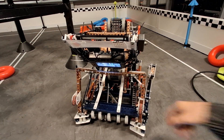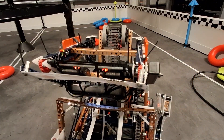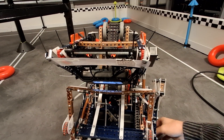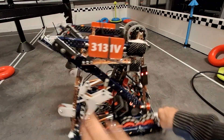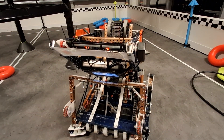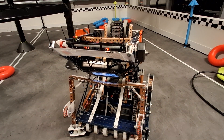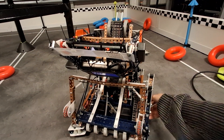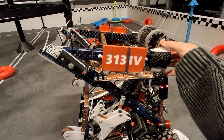We have ramps in there — they're kind of broken right now, the tips came off, but we have spares and just never changed them. The intake ramps are polycarbonate; everything else is Delrin, cut with our CNC or laser cutter. For intake, it's pretty standard five flex wheel — pretty smooth, low friction. We never had the intake overheat in a match.